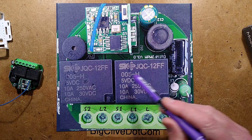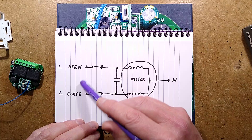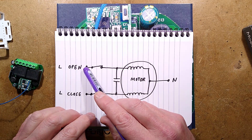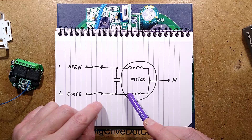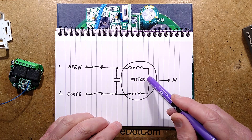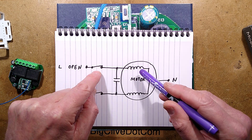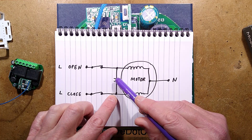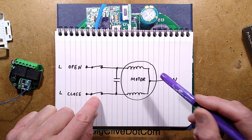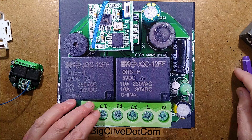To give you an idea of how this controls the motors: there are two relays that switch live to live-one and live-two, and you wire your motor between neutral and the two outputs. There are open and close inputs - if you energize open, via a limit switch it powers one winding of what I'm guessing is a synchronous motor to neutral, but also powers the other winding via a capacitor that causes a phase shift, which causes rotation in a specific direction until it hits the limit switch and stops. If you then power close, it powers the windings in reverse and winds in the opposite direction until it hits the other limit switch. It's used for things like raising and lowering screens - a common circuit arrangement.